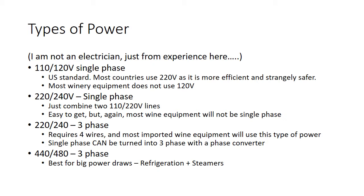Most equipment isn't single phase. Three-phase requires four wires, and most important winery equipment will require this. Single phase can be turned into three phase — there used to be motors, but now there are digital phase converters. This is important because if you have to bring in three-phase power — which one of our local wineries did — you're talking many tens of thousands of dollars: $20,000, $30,000, $40,000, $50,000 to bring in service. We also have 440, 480 three-phase.